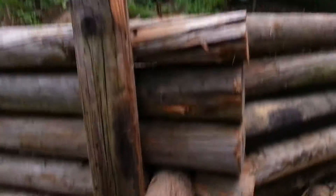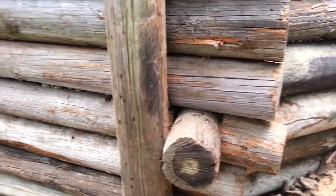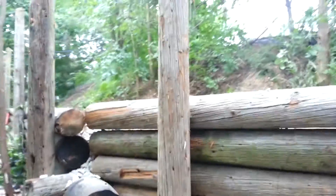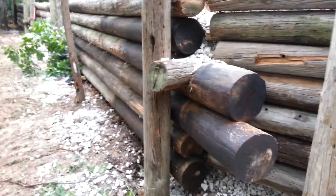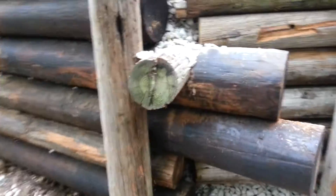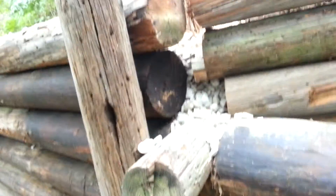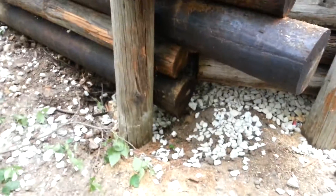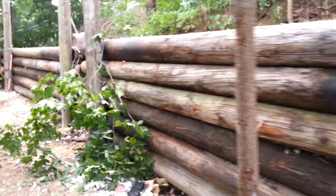I run my dead man in here, tied it to the pole and to the wall itself to keep it from going out. I'm about midway up — here's another dead man I put in. Those are of key importance in keeping the wall there. As you can see, I got braces up there going to those trees just for safety, to keep the wall from coming out when I'm riding the bobcat over backfilling.